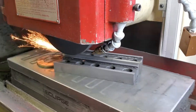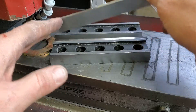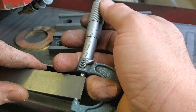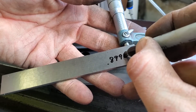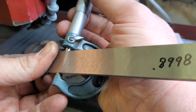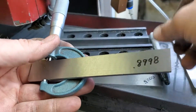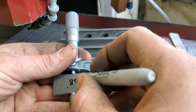And now for the final reveal — it worked out quite adequate. I had to stone off the surfaces to take off the very sharp hairline burr that was on the edge, and then we were going to measure. The final result isn't too bad — I'm really only two tenths of a thou out, and I'm pretty happy with that. The surface finish on the top and bottom turned out to be fantastic. However, the surface finish on the side that I wrote on — not so awesome. The stone could be balanced a little bit better; it created a bit of a frequency because I was in a bit of a rush to get the sides done.